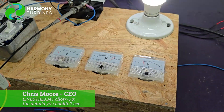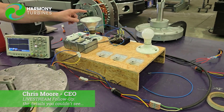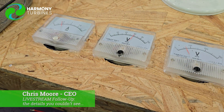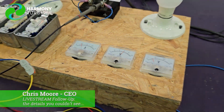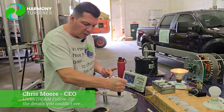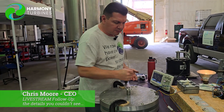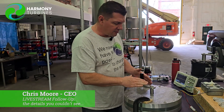This was some of the stuff you couldn't see the other day. If we add the load to it — where this is the more heavy load — we're still maintaining 50-60 volts of power and I'm getting half an amp here. And I'm just spinning it with one arm. The turbine will be able to do a lot more work out on the roof or in your yard — this is just maybe putting around 80 watts into it.